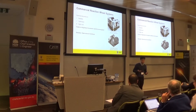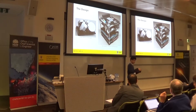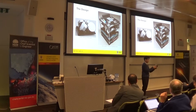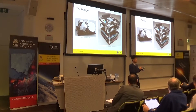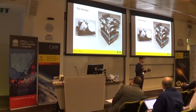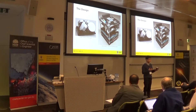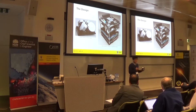Over the course of roughly two months, we designed and manufactured our first prototype. On the top half of this CubeSat is the reaction wheel system itself, and at the bottom half we have the support systems: a basic power system, onboard computer, comms, and sensors for the ACS. Now this is not space-worthy — it is simply hardware to demonstrate that our design actually works.